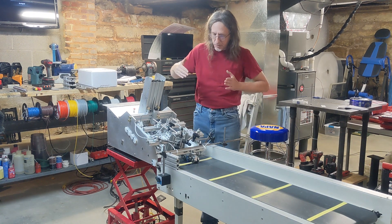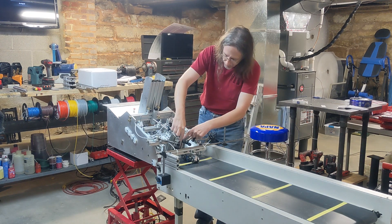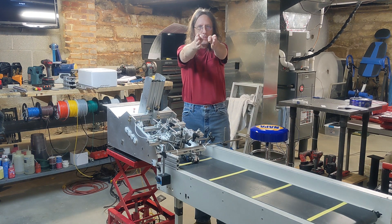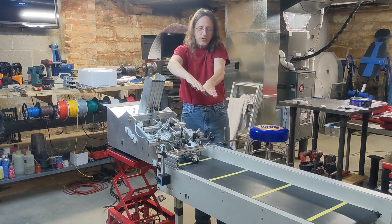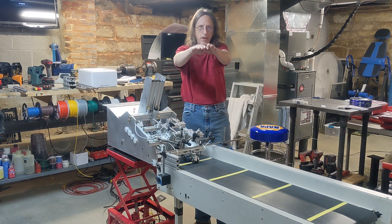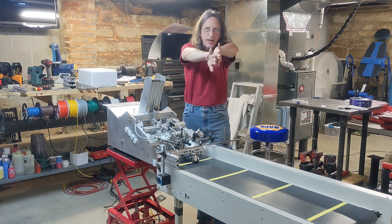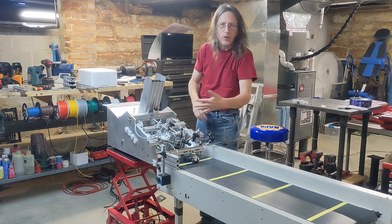So once it comes out and stops, the photo eye says feed. It goes to feed that. And right here — I'll give you some close-ups — there are some vertical bearings right as it comes out that take the edge of the stock and bend it over more. So when it comes out and lands on the conveyor, it's going to spring back open a little bit. But on customers' conveyors, they have a side, so it'll come out and land in the groove and it's not going to open back up.